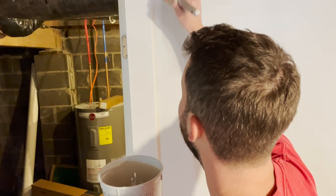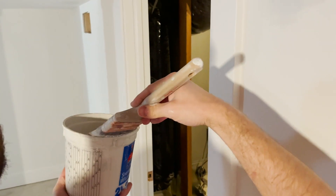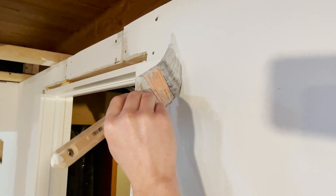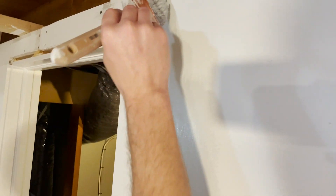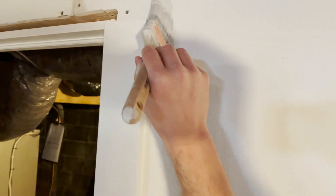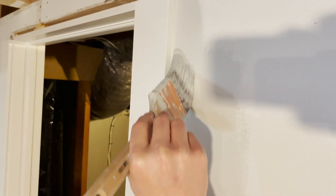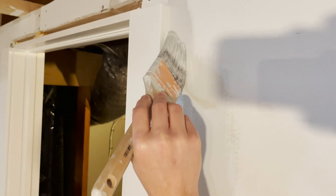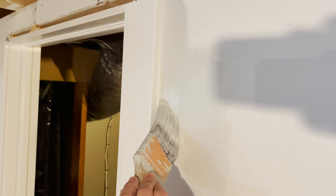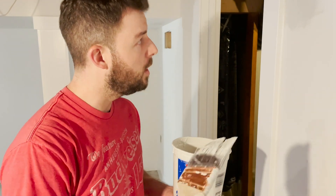So I'm going to dip - you don't need a ton of paint - wipe it off here, and go up here. You want to get a nice bead of paint going, then just bring it down along the side and it's almost going to just bump up against where you're going. You don't want it to bump too much, just a little tiny bit. You can see the bead of paint. Test it out in a closet first where it's not a big deal and you'll get the hang of how the paint rolls. The sides and tops of door or window trim are pretty easy.